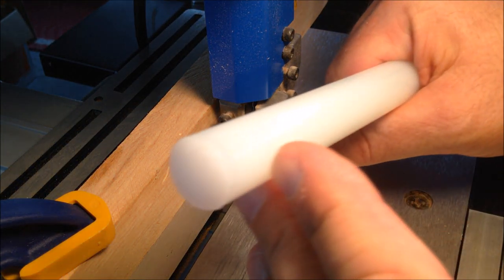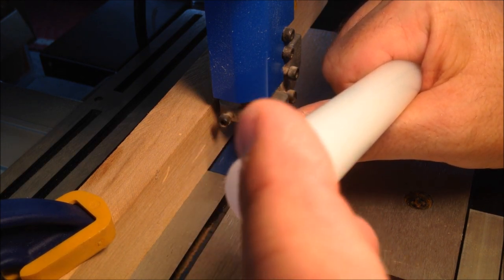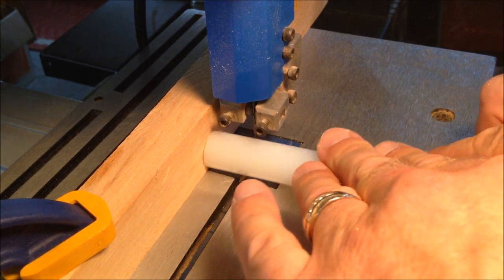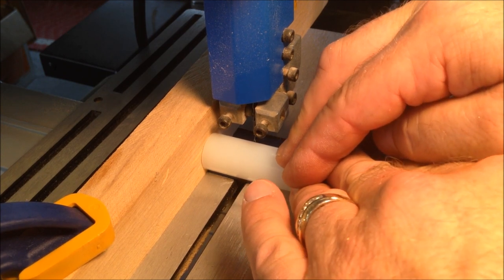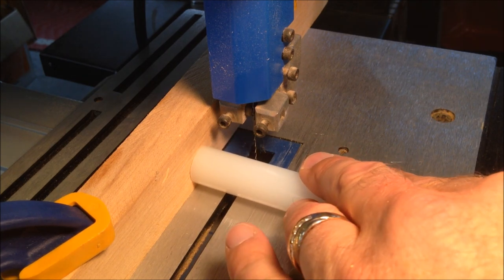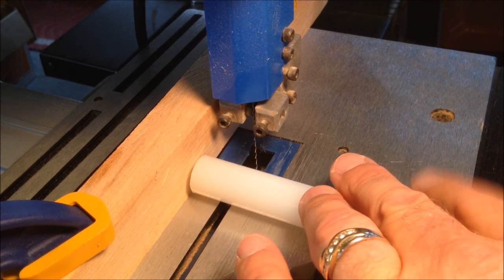Let's go make some bushings. The diameter on the rod I purchased was 3 quarters of an inch. The reason I went with a 3/4 inch rod is because in case I don't drill perfectly down the center, I still have plenty of meat to true the bushing up. I've also decided to cut a 3/4 inch thick segment off the rod to make my bushing. My thought is that as it gets chewed up by the inside of my tubes, I can always trim the chewed-up section off and get more life out of the bushings.